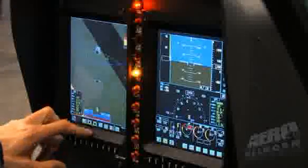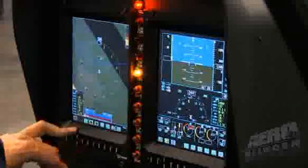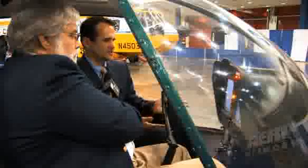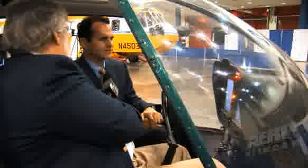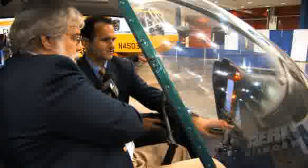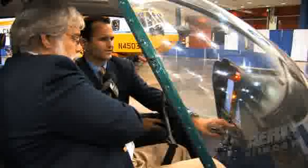Positioning the aircraft here is at the bottom of the screen. The electronics allow you, if you're flying more by pilotage and dead reckoning, to move the aircraft to the center of the screen, and you still have your radii and your distance rings. Going digital in a glass cockpit also allows a few other advantages that are sometimes taken for granted. The synchronization button on this suite allows me at whatever heading I am to just press synchronize, and it takes the current heading and positions a bug there. You can do the same for your altimeter.